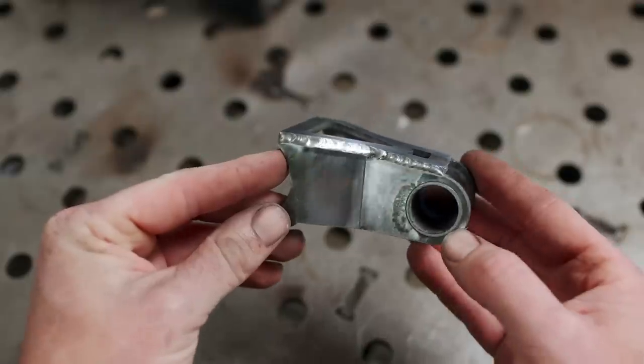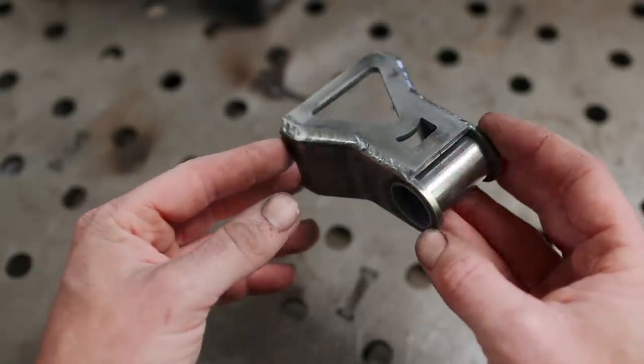All I had to do was head over to the lathe and machine some small metal inserts to go in the middle — the housing that will ultimately hold our bushing. The tolerances of the SendCutSend parts are fantastic; everything fits together exactly as I hoped, a nice snug fit without needing a press for assembly. All of the joints were designed as corner joints, so it's just a matter of filling them in with 1/16th filler rod, and the outcome is pretty decent. I'm always a critic of my own welds, but seeing as these will be up front and center in the engine bay, I'm not disappointed.